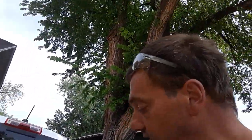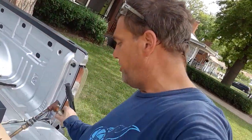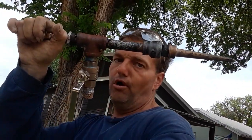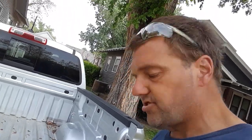The reason I'm showing you this is you don't have to use it just for power washing — there are all kinds of reasons to combine compressed air with a fluid. This particular version I use to spray used oil into my shop heater, switching the oil to the small fitting and the air on the big fitting with just an air mattress blower. One important note: if you go this route, never turn the air off first — always turn the oil off first.